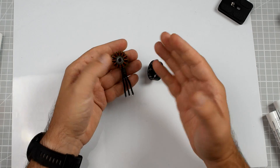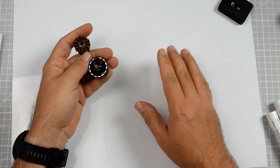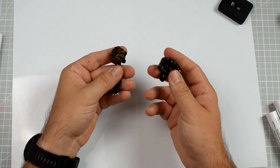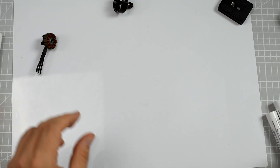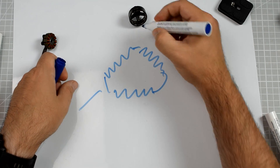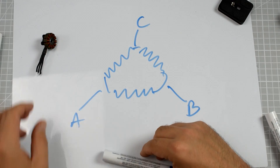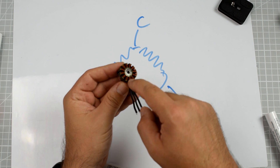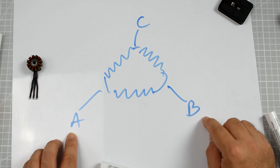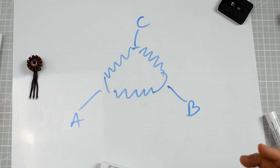This is an electric brushless motor. It has 12 coils, 14 magnets and 3 phases. If you want to know more about motors, I have a special video about this. We will only be talking about motor timing. This 12-coil, 14-magnet configuration can be simplified to something much simpler — to 3 coils connected between 3 phases. Because internally this is more or less how everything is connected, as each coil is the same electric circuit. They are terminated and as the result they make Phase A, Phase B, Phase C connected into the winding termination called delta — because it's a delta, it's a triangle.